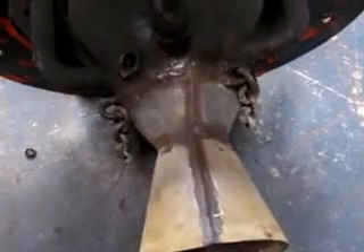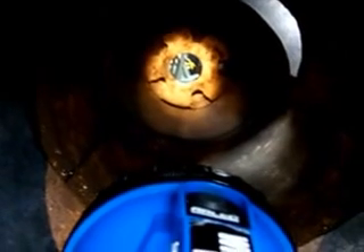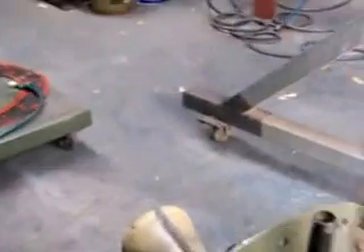I'm going to go around to the top of the hopper, turn the torch on, and you'll be able to see how they poke through. I'll just poke my head in through here — as you can see down there, there are the five nozzles which I can unscrew through the side port. That reduction is just not deep enough. I believe going the other way around would be much, much better. I have a two-and-a-half-inch reduction zone in there. I was going to make it a single nozzle setup, but I've been advised to leave it as a five-nozzle setup. I get a lot of turbulence with the five nozzles, but I think it's due to this cone setup.